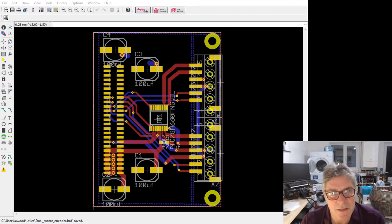That reminds me, what I did see, I forgot to mention this on the news, USB-C I think goes up to like 100 watt. I saw an announcement that they're going to take that to 240 watt. There's a new version of USB-C coming down that supports up to a quarter of a kilowatt, basically. Not quite sure how they're getting the power over there, whether they're doubling the voltage from 20 to 40 or maybe going up to 48 or something, but keeping the current the same. I'm not sure how they'd increase the current, given the physical dimensions of the pins on the connectors, as well as thinking about the conduit itself. They'd probably have to up the voltage.